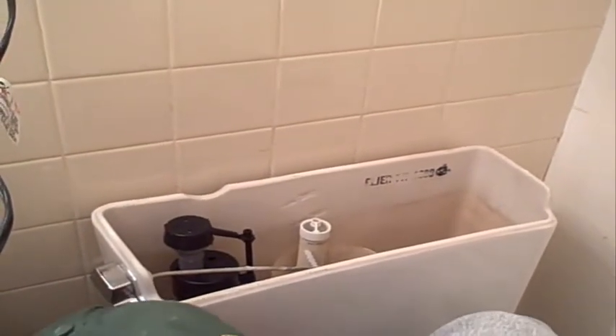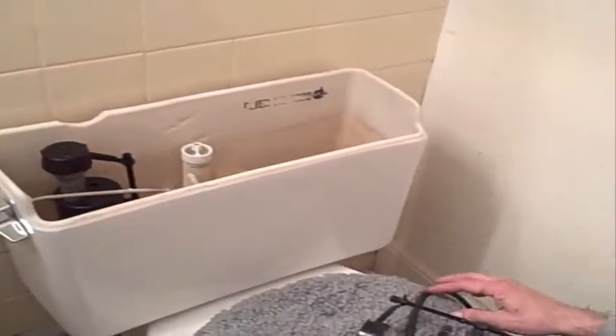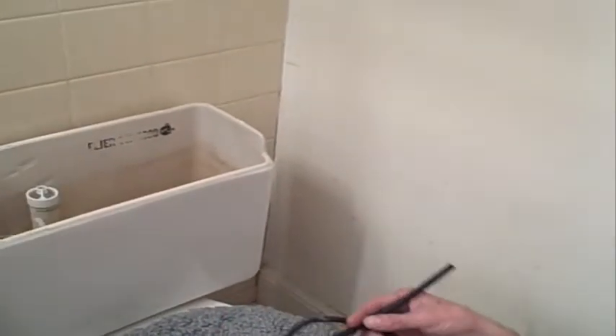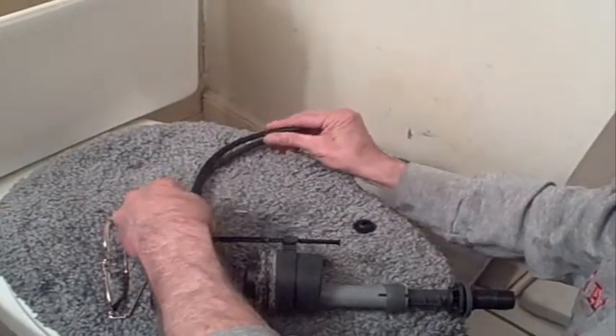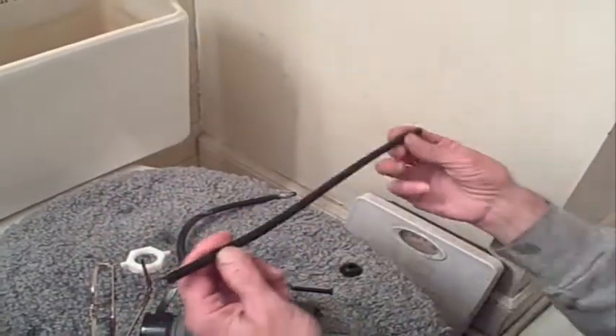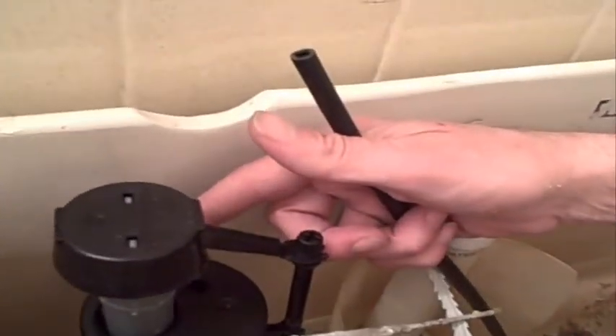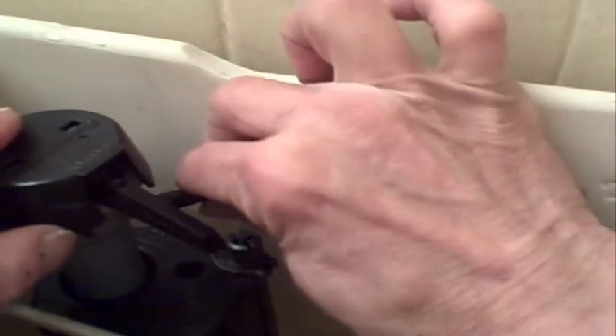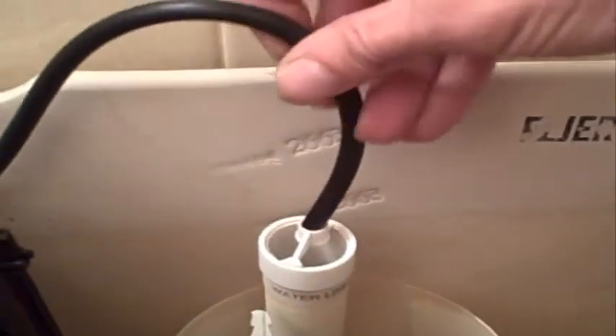There's a little black hose that comes with the kit — measure it up to your old hose. I usually don't cut them; I like to leave them the same length. Now up on here, look right here where my fingers are — there's a little piece that sticks out. The hose plugs into that. Hold the center thing and it will go on — just wiggle waggle. Once you've got it wiggled in, slide it down the little hole in the middle of your toilet.